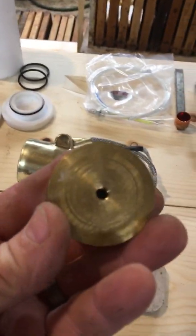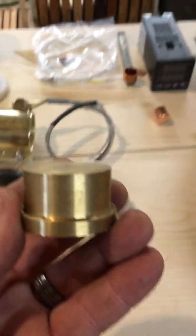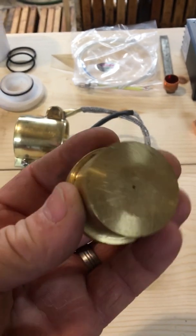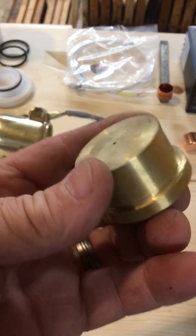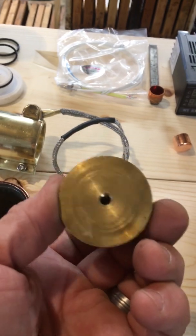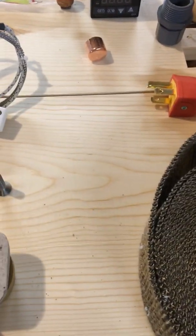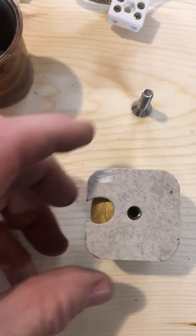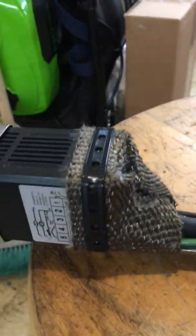This is the key to all these vaporizers: the brass billet inside gets heated up by the band heater. Brass has better thermal retention and density than aluminum or whatever others are using. You could use steel, but if you're going to use steel you might as well do brass. Then you drill a quarter-inch hole for the 20-thread thermocouple, which gives you your temperature reading for the PID controller.